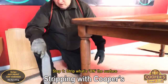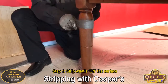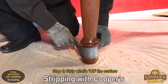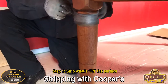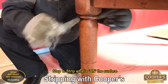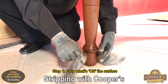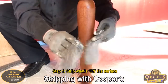Now steel wool comes in these big rolls and you can just cut it off to whatever length you want. Normally stripping a turned leg is pretty much nightmare stuff, but this is easy. And the thing is, this is one of the only times we actually go cross grain. But when this leg was made it was on a lathe and it was going cross grain, so I'm not doing anything different to when it was made.